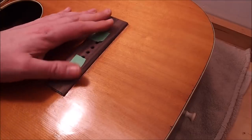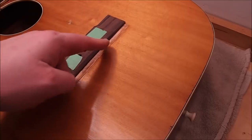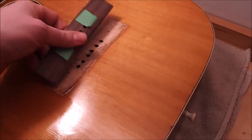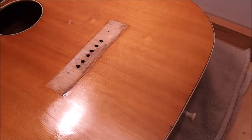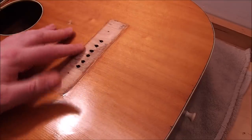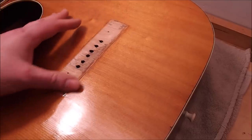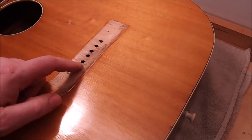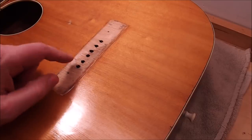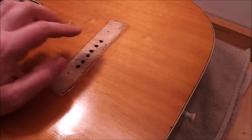I'm going to be shifting this new bridge forward slightly to account for that misalignment. The oxidized wood where the previous bridge wasn't in contact with the top is still visible — quite dark — and I'd like to lighten that up if I can to make it blend in. I will eventually repolish the entire surface; there's actually quite a lip of shellac around both sides so I'll have to flatten it out, do a little light sanding, and then repolish. There's a chemical that will do that really nicely on spruce and other softwoods — it's called oxalic acid.